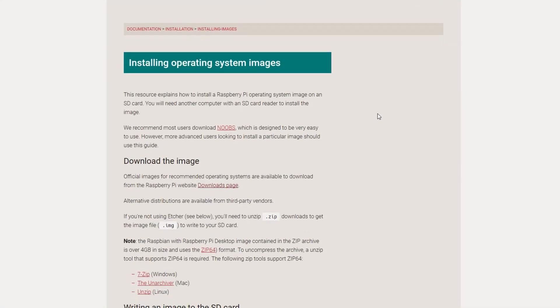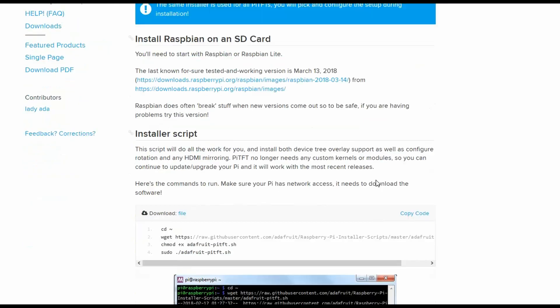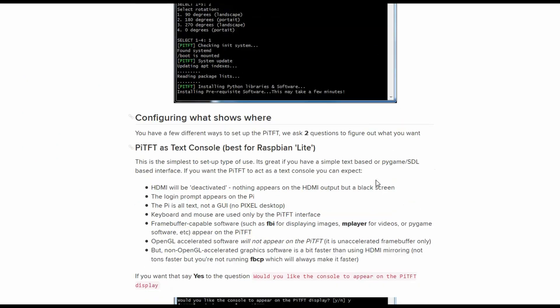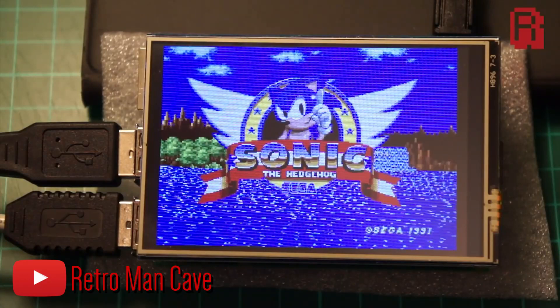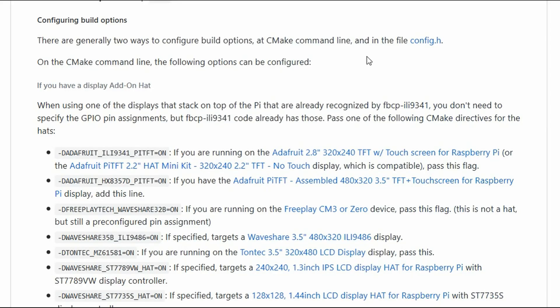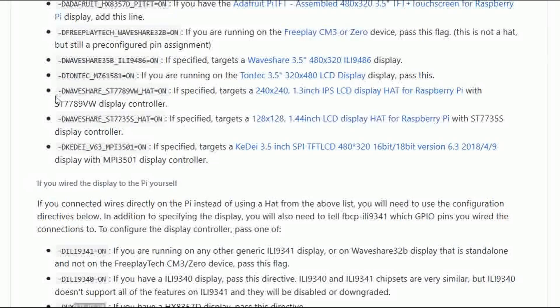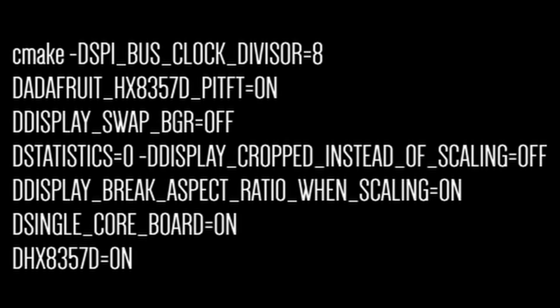The next thing we have to do is install some drivers to allow the screen to communicate with the Raspberry Pi. I first tried the Adafruit drivers since my screen is an Adafruit screen, but they were just horrendously laggy and not well suited for this portable, especially for gaming. So I uninstalled them completely and instead installed a driver called FBCP-ILI-9341. To install it, you need to edit the boot text file and then SSH into the Pi and install it through the terminal. The trickiest part is self-defining each aspect of your driver in the initial code with flags. I struggled with this for a few days and eventually got help from the creator of the driver, which was really cool. Here are my final flags for the Adafruit TFT display — you can also find them in the video description.